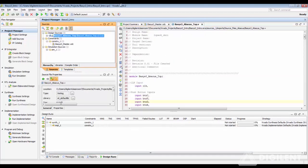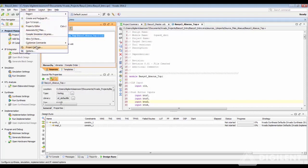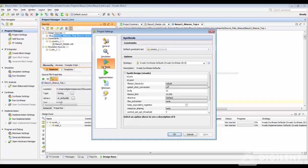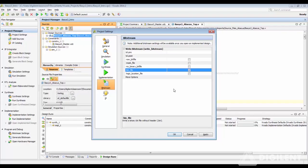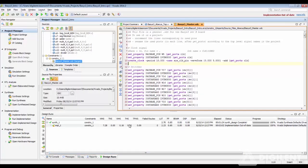So what you need to do is go into Tools, Project Settings, Synthesis, Implementation, and Bitstream information is here. You can go into Bitstream and check the .bin file. This binary file allows you to add a memory configuration file into your FPGA flash device. When you power on your device, you can directly run your project and you don't have to program the FPGA every time. For this, let us set some device properties beforehand.